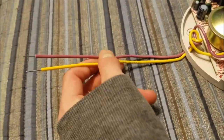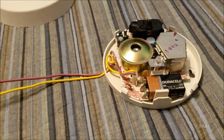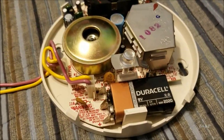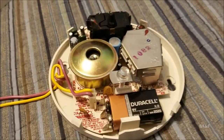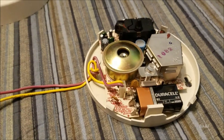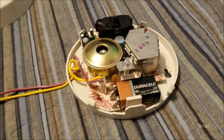Now about these two wires: this is a battery-powered unit, not hardwired with battery backup — strictly battery powered. These two wires are interconnect wires. This is BRK's very first attempt at interconnected battery-powered units. This feature wasn't continued on the 79R, but it was brought back in a separate model, the 79DCRI — a rectangular or square model using the same base cover as the SS74 — which also had interconnect capabilities and possibly a relay.